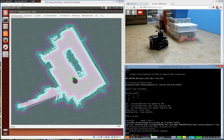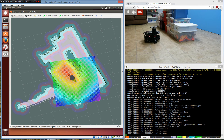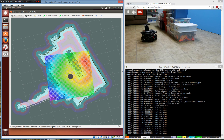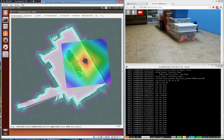So now this is what's really fun. We've got a map, we've got a robot. I've turned off the keyboard operation. Now we're going to set a 2D navigation goal — we're going to say, hey, I want you to be here, and I want you to be facing that way. It makes a plan, and it drives. Now you've got an actual robot operating. Let's do a more complicated one — here's a 2D navigation goal: I want you to be over here and facing back that way. What's it going to do? It's made a plan — it's going to turn around, drive over there. It's doing this all by itself. All I've done is told it where I want it to be and which direction I want it to be facing when it gets there. Now it's actually driving around and going to that location all on its own using a combination of the map it's already made and seeing the surroundings. If the odometry gets confused, if it slips, it can use the map to refresh itself and say, obviously my wheel slipped — I thought I went three feet but I went two.